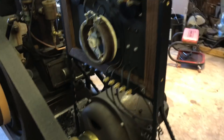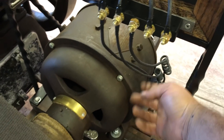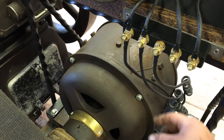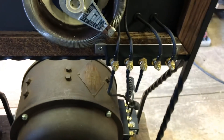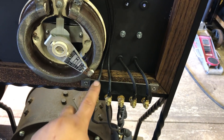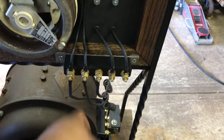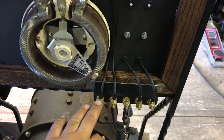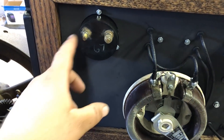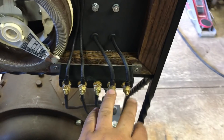Let's take a look at the back here. Made another one of these terminal blocks for the back of the control panel. Just brought my three leads — the positive and negative output leads from the generator and then the one series field lead. The field circuit is done: got armature positive coming out, going through the knife switch, through the field rheostat, back out the knife switch to the other end of the series field. This lead will also be jumped off here and run up through the ammeter. This is a direct read ammeter, which is nice — I don't need an external shunt. So it'll go through the ammeter, down through the fuse block, and back out here. This will be the ultimate load output — positive and negative.